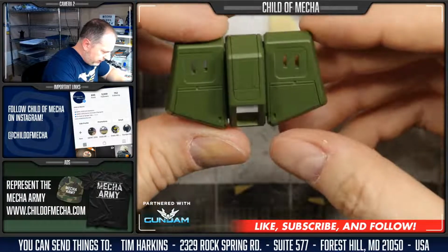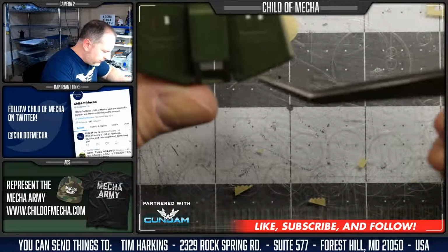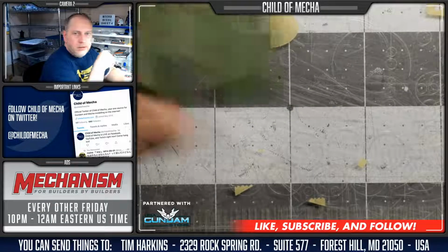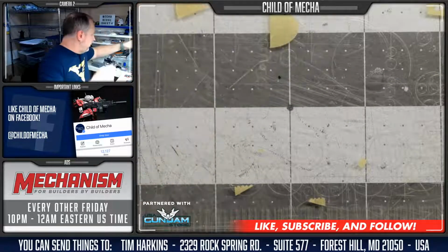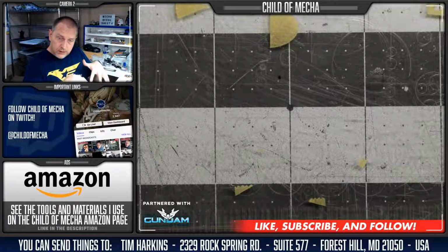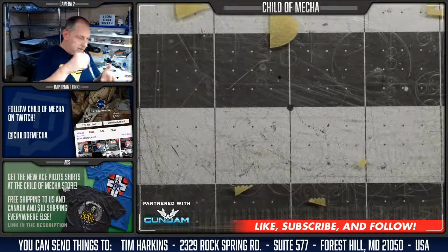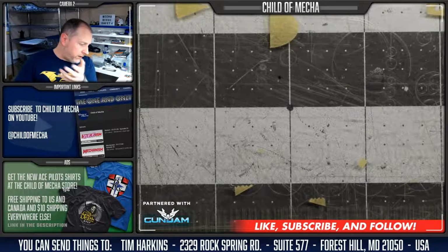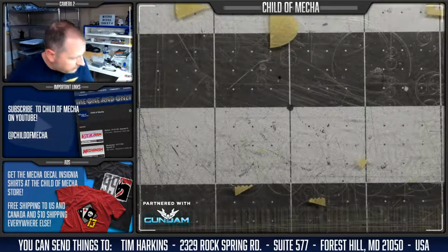Yeah, see, this is a little splotchy, and I find that it's in the parts that have larger flat surfaces like this, because when I lay down my wet coat, it all looks fine. You should lay down a mist coat first, just to get the part kind of tacky, and then go back, rotating the part and everything, and then spray down your heavier wet coat. So in a wet coat situation, everything looks fine, right? Not. It might not be.